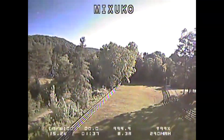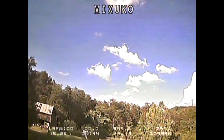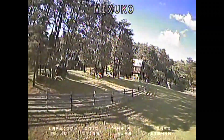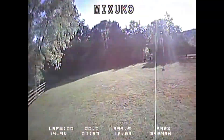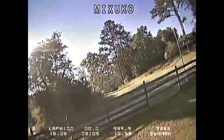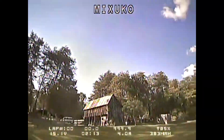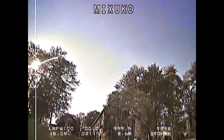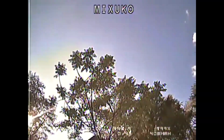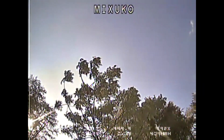That's pretty good. I'm not going too high on the throttle because I don't want to induce those P-term oscillations that would then affect my result. On the pitch axis and the yaw axis, I'm not seeing any movement. I feel like it may have dropped the nose just a little on a swoopy turn, but overall that feels pretty good for the I-term — pretty much where it needs to be. I wouldn't fly with the P-gain where it is now. I don't like those high-throttle oscillations.